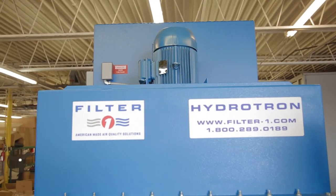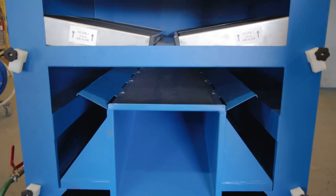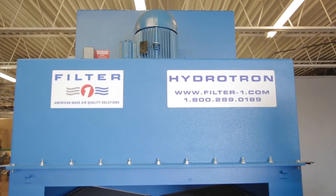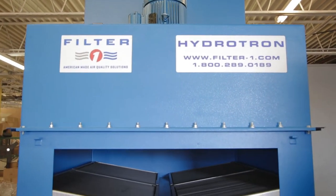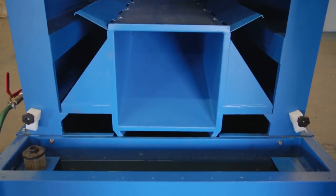This is a motor out of the Airstream design. Standard on all NGs is motor out of the Airstream. It would also be spark-resistant. If you did order a unit spark-resistant, it comes with an aluminum wheel — unless it's such a challenging application, in which case we'll go with an aluminum cone and a steel wheel.